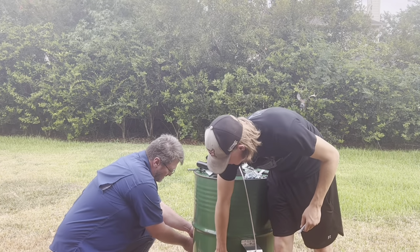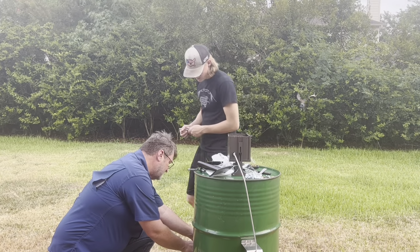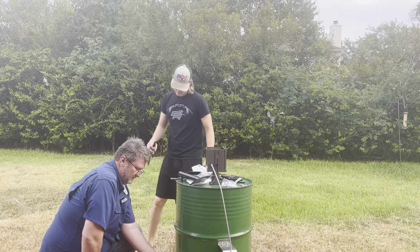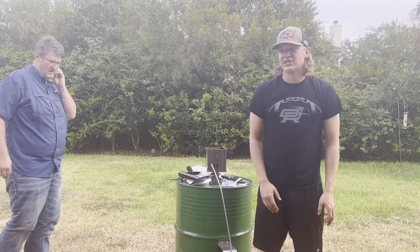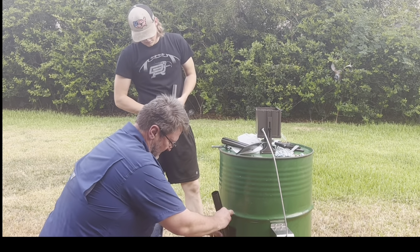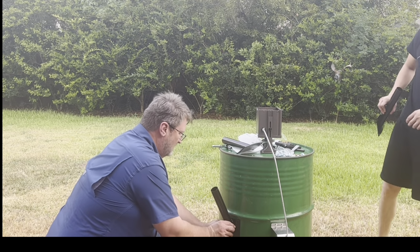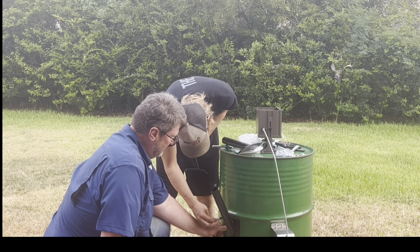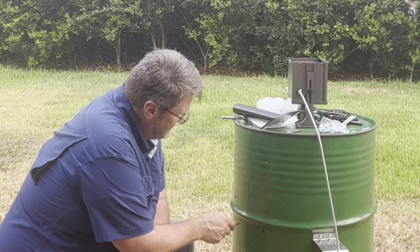Well, obviously a metal measuring tape would work a lot better for more accuracy, but 70 inches divided by 3 equals 23.3. Just gonna do our legs a little bit further up on the barrel. I've seen them down here, but I feel like that just makes your barrel top heavy and puts a little bit more strain on the legs. We marked it down there. So this will give us a rough idea. And then you want to mark the holes? Yep. Right here, just about center. These don't have to be perfect, just very approximate. I've got my hole punch so I can get this started.